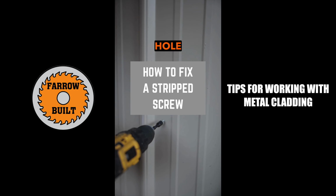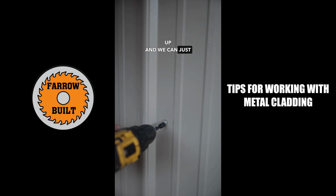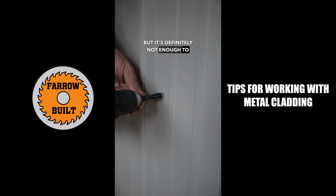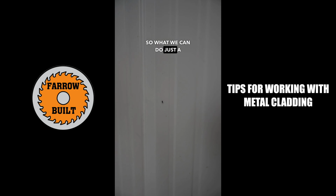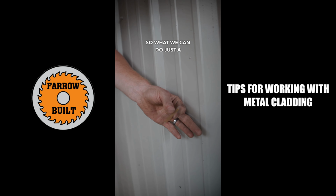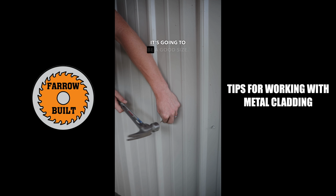This screw hole is stripped out. You can see that it never tightens up, and we can't quite pull it out, but it's definitely not enough to keep that waterproof seal. So what we can do is use just a little piece of wood, just a little sliver like that. Sometimes you have to get a couple in there, but this one seems like it's going to be a good size.